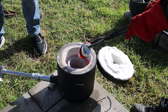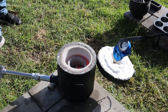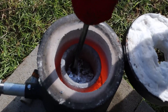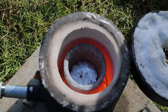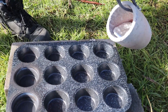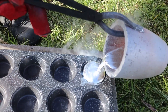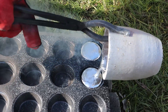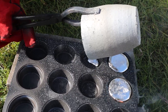The way I do it is to keep melting cans in until you have a nice pool of molten aluminium. The only problem with melting aluminium cans is that there is still so much slag that comes off and needs to be scraped at the top before you can pour. When it's time to pour I turn off the foundry and grab the crucible with the tongs — there are special tongs you can buy just for this but these ones will do for now. I'm using a muffin tray to make these little ingots ready for re-melting. The tray catches fire and lets out a horrible smell, and that's just because the non-stick coating is burning off, but this will be the only time it does that.